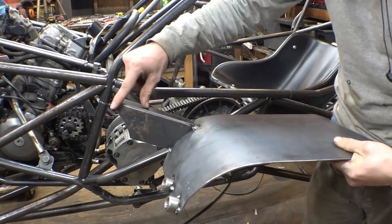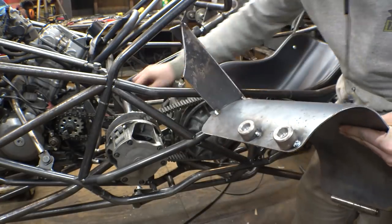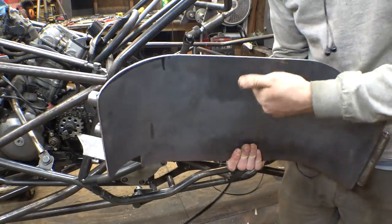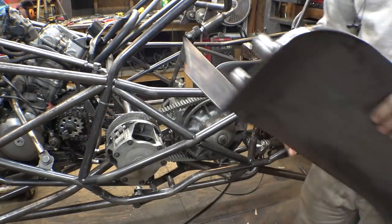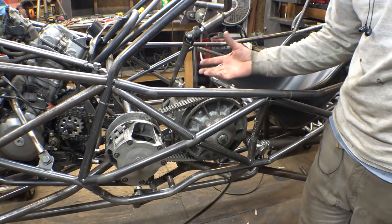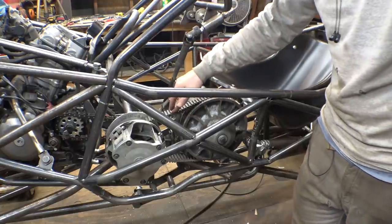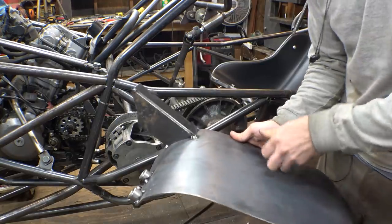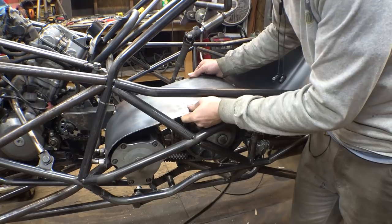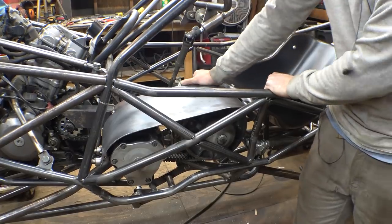You can see I had to add this portion right here to protect my foot from the chain. This is where it attaches to on the front. Basically these right here are like that, and then the receiving end is welded on the frame right there. I made sure that this is strong enough. This is 1/8 inch thick plate steel because you guys keep saying that these belts have a potential of blowing up if they get worn or whatever it is. I wanted to make sure that worst case scenario, if this belt ever does blow up, I doubt it's going to go through 1/8 inch thick plate steel. So to put this thing back on, all I gotta do is put it back into place, hit it just like that, put the pin back in, and now it is back installed.